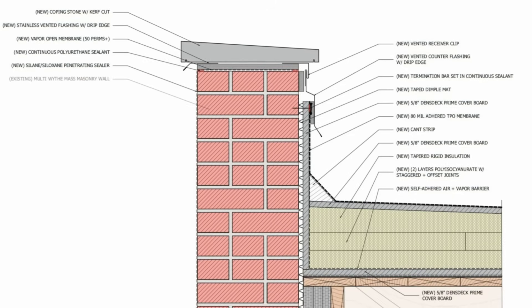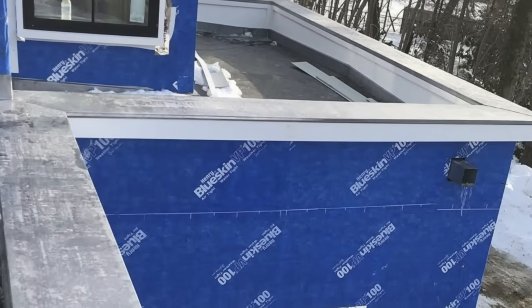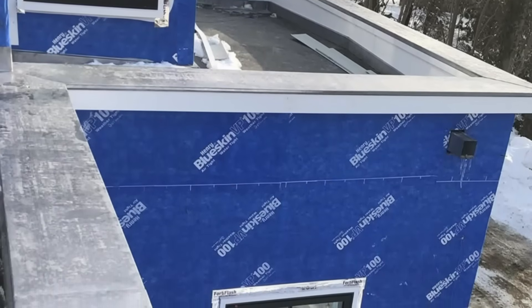The client also reported brown stains and drips around their exterior facade around where they had parapets. When we observe stains like this around parapet walls on the exterior facade, it's usually an indication that we don't have proper drips in place to direct water away from the wall and break surface tension. It can also mean that the coping — the metal or stone cap on top of parapet walls — is sloped outwards to the exterior rather than inwards, or it could be a combination of both.